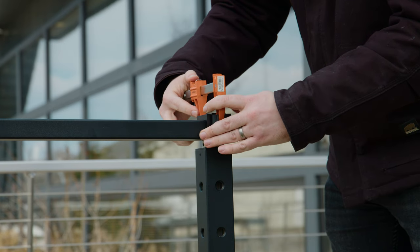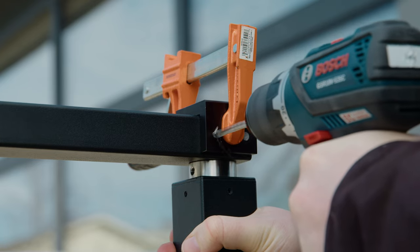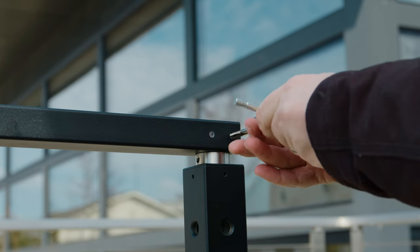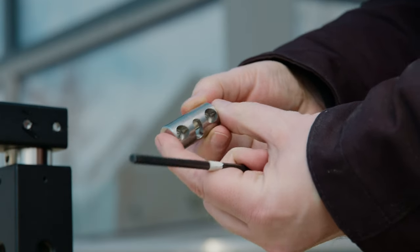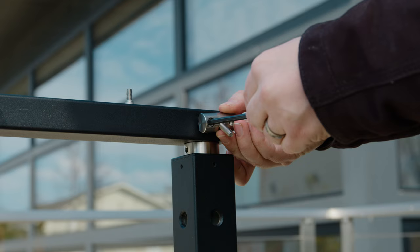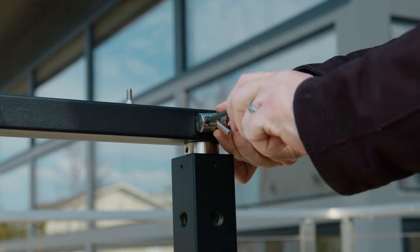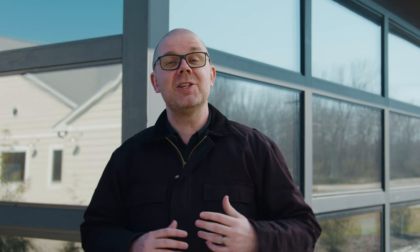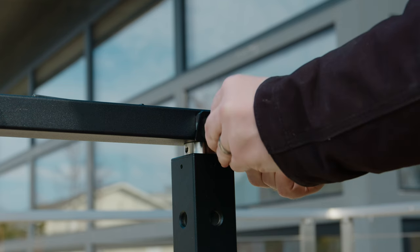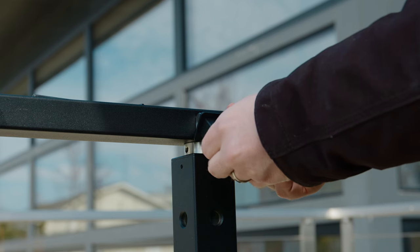With our position set, we'll secure it with a clamp. Next, we'll drill our two pilot holes with a 7/32nds drill bit, tapping both with a quarter-twenty tap before bringing part B into place. For the hinge itself, we'll make sure we've set the pivot screw in the center slot, and then install the hinge by driving in two quarter-twenty by half-inch screws with a 3/16th Allen wrench. We'll bring in part C and slide it over the screw, making sure that part B will lie in the curved bed of part C. We'll now loosely secure this with a nut, making sure the hinge doesn't completely lock in place — we want it to be movable, but not so loose that it moves without touching it. Now we're ready to set the angle of our hinge, following the steps from earlier to finish this section.